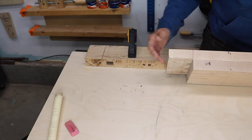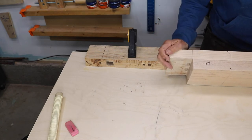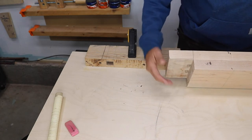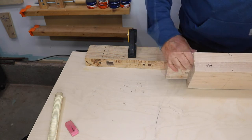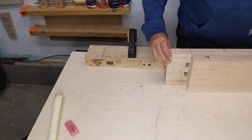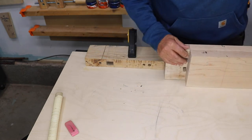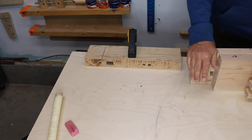Here's what we've ended up with. We've cut away using the large router bit. I'm not a fan of using the little half-inch router bits and working over and over again — I like the big one-inch, which works much faster and seems to have more control. I've got a nice square edge, and I've left my one and a quarter inch tenon here. In this particular case I've drilled using my bench-top mortiser two relief holes so I can now work on cutting out the fingers.